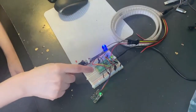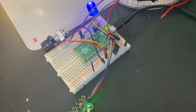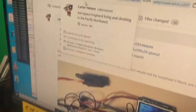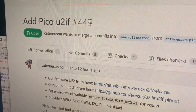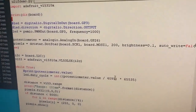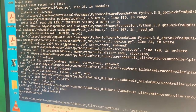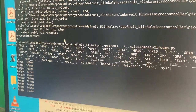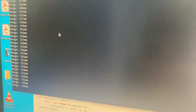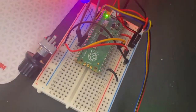What's interesting about this code is it's actually not running on the Pico. This is actually written in CPython. We're trying out Pico U2IF. We're running on the Pico, but the code being run — the CircuitPython code — is actually on my Windows computer, running in CPython. It's communicating over HID to the RP2040 to execute all the hardware commands. This is kind of like all-in-one CircuitPython for CPython.